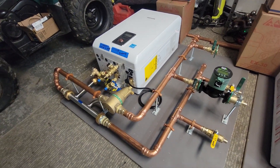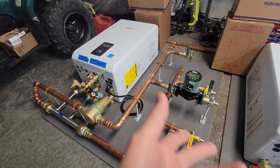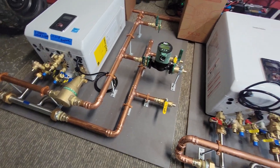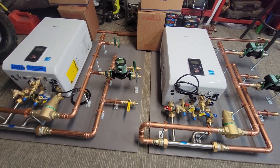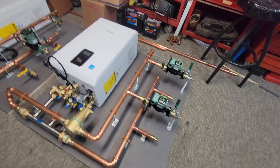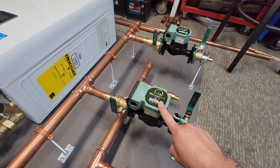Those are really, really nice. The customer wanted the ability to adjust it automatically or set it himself, so we upgraded them to that pump. This is for an in-floor system — actually both of these are for concrete in-floor radiant heat. Again, a two-zone here, and this one also is actually a two-zone.